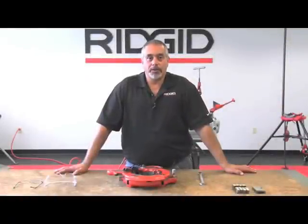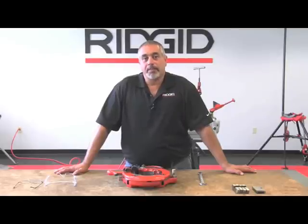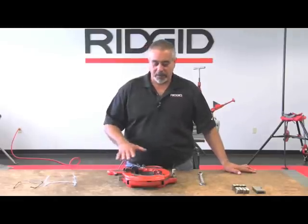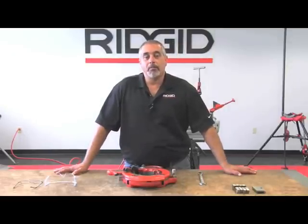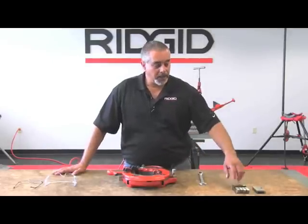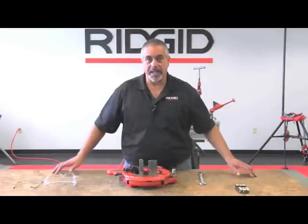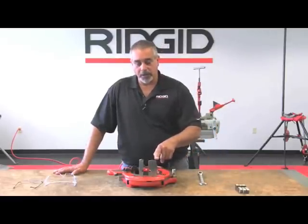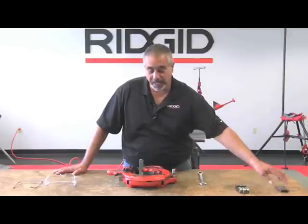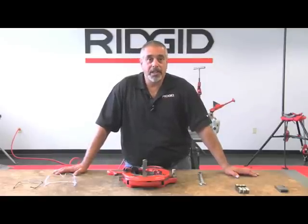In this portion of the video, I'm going to show you how to install the dies on the 714 die head. Before I do that, I want to explain a couple of things about this die head and how it works. This is called a receding die head. By way of a mechanical process on the die head and on the machine itself, the dies actually back themselves off of the pipe to create the taper on the thread. Here you have a receding die, and here you have an older die from a 415 die head. The receding die reduces the amount of friction applied to the pipe, so your dies last longer, your machine works less hard, and it's simpler to use.